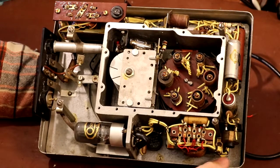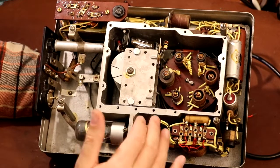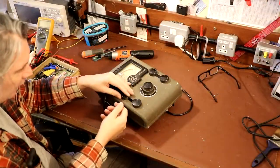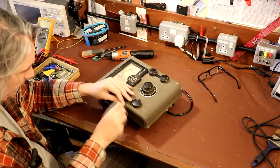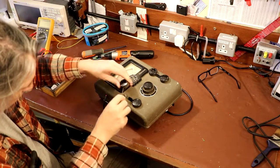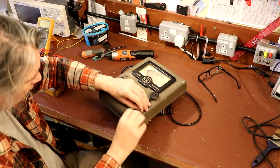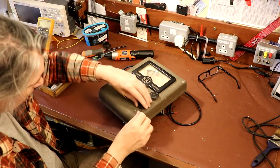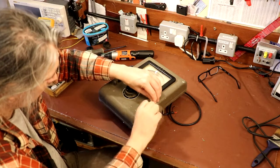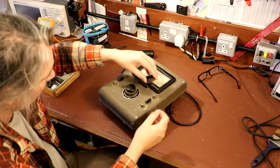I think we've got to take all the knobs and everything off and then disconnect the chassis from the front cover. Not exactly sure how we do that — we'll have to play it by ear. Well, I think it's about time for some de-knobulation, so let's crack on with that. Oh, some lovely filth under here. I also remember there's a selenium rectifier under here, so we're probably going to have to replace that as well. At least the knobs didn't put up a fight — that's good.